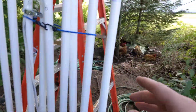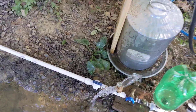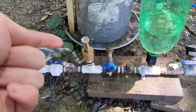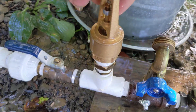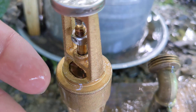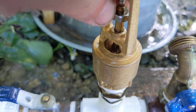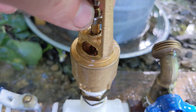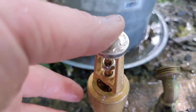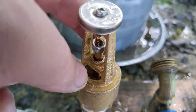It's definitely working a lot better than the swing check valves. I just need to work on a way to make these last a very long time, because these foot valves have brass sliding on brass, which wears them out quickly. I don't have personal experience on that yet, but apparently they wear out — brass on brass is not good. It would be good to put some sort of bushing material in there, or completely redesign this to be longer lasting with an adjustable downforce weight.